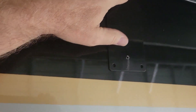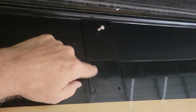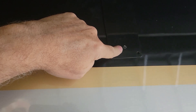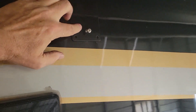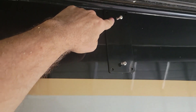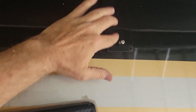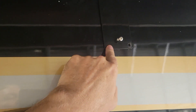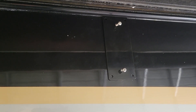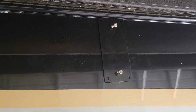I got the plate with the two holes I drilled lined up with the hole I made earlier when I missed the stud. I got them started, and now I'll mark and drill those — that'll get the plate mounted. Once the plate is mounted I'll come back and get the four outside ones drilled, then take everything apart and seal it. I marked the top and bottom, used the same hole from earlier, and now I've got the plate temporarily mounted. I'll mark and drill the remaining four holes to get the plate permanently mounted, then get the cradle mounted and seal everything up. This is not the way I anticipated this project would go.